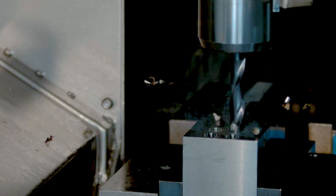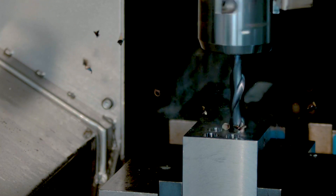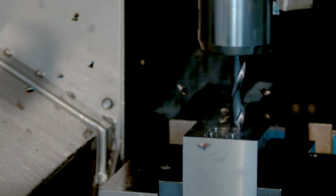Now consider chip evacuation. Where do the chips have to go? Think about it — when making a hole, the drill goes straight into the material. The hole is essentially the same size as the tool itself, so the chips have nowhere to go when they're cut. That's why chip evacuation is so critical. You can't have chips stay in the hole, otherwise they will get in the way of the drill point reaching new material and recutting chips. This is often how drills break and how hole quality is decreased.